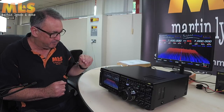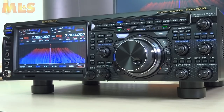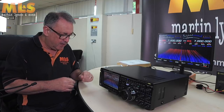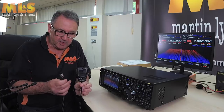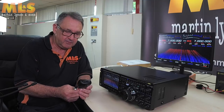After the reset, both receivers come on at 7 MHz by default. So the first control is obviously the power button. You've got two USB ports on the front, both for your mouse and keyboard or keypad if you're doing RTTY. There's a duplicate quarter-inch key jack on the front — stereo — depending on whether you want a straight key or paddle, as I mentioned earlier. There's a phone socket — again quarter-inch stereo — so you can have the main receiver in one ear and the sub receiver in the other. Then the microphone socket is a standard 8-pin connector.